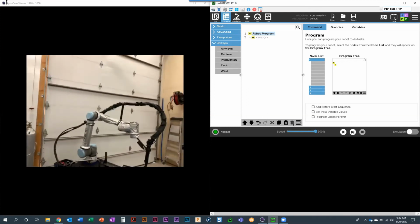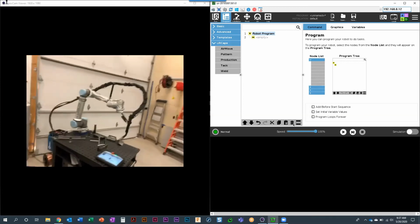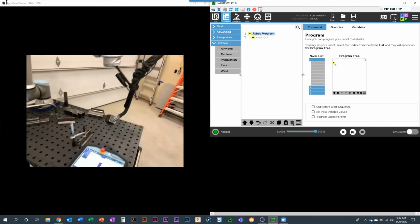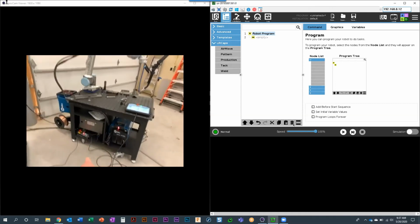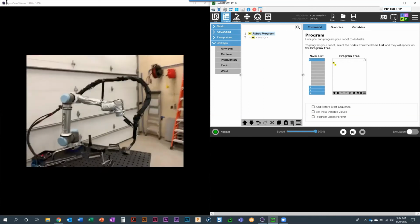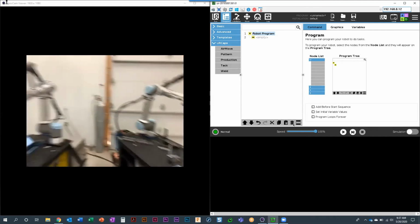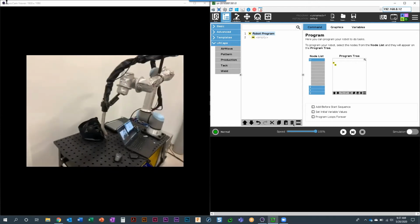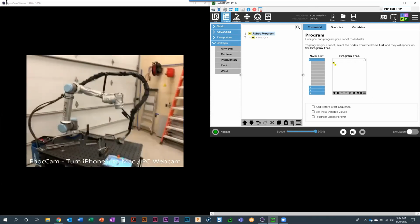All right. So here's our system. This is our standard base system with an air-cooled package that you're seeing here. It's on the mobile cart that you see. It has the Miller welder, the robot brain, an op panel, and a wire feeder on the back. Everything's electrically isolated, and then our air-cooled torch as well. And just to show, this is our water-cooled version, where we've got a water-cooled 400-amp torch with a water cooler on the back as well, still mobile and portable.